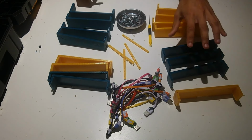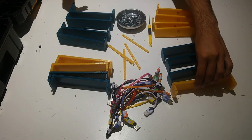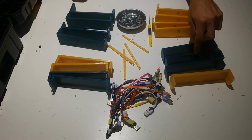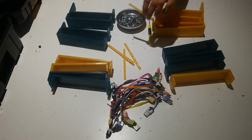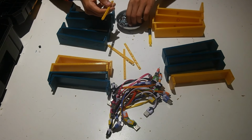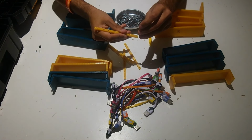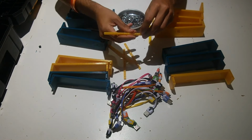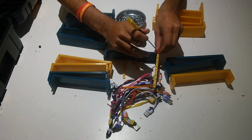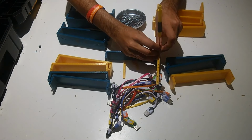In this top left part, in my top left, which is your bottom right now, I'm going to show you the parts that go in the top left of the TSTAK. So that's part C, A. I'm going to show you how we assemble these parts. Take these brackets, and take a couple of your 6/32 screws. The 6/32 screws just go into the bracket, and then you can take your Allen wrench and thread the 6/32 screw into the 2 holes on the top of the bracket.